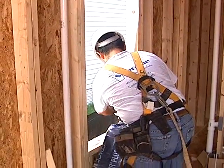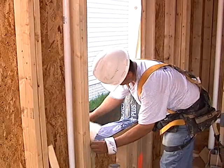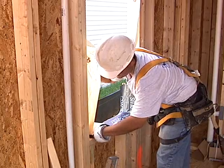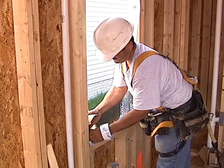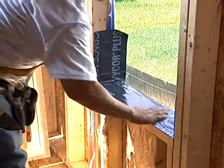To ensure proper water drainage, one must install flashing around the window opening. We start by installing sill flashing on top of the house wrap so that any leaks on the sill flashing will flow on top of the house wrap and out, and not under the house wrap against the sheathing. In this case, the sill flashing material is a continuous flexible self-adhesive material.